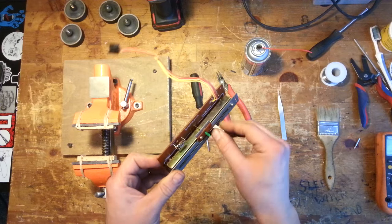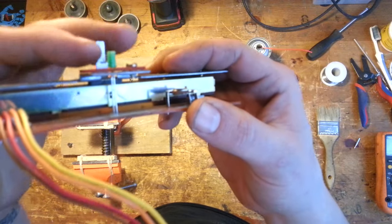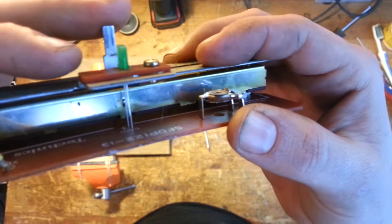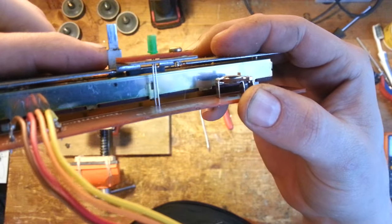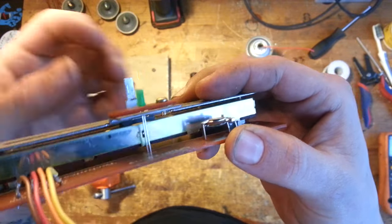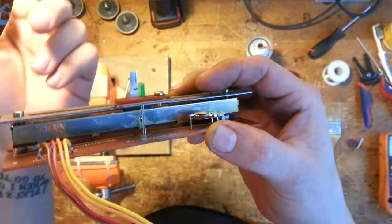Normally these have that center stop that most of you watching this are used to. If you look inside the fader, you can see there's a small little ball bearing in there, and when we ride along the fader wall it clicks into place. What you have in there is a small steel ball with a little spring behind it, so that when it's rolling along and gets to that point, the spring finds the hole and that's what makes it click and hold zero.